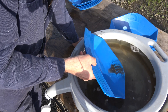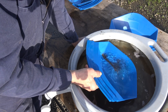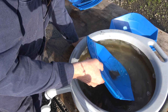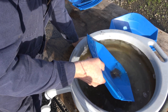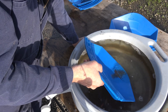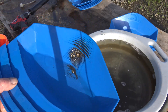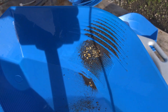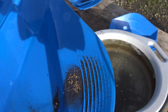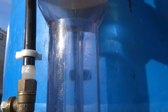There's some pretty dense stuff, no doubt about it. Now we got gold working its way over — look at all that gold! Let's just do this one more time. Boy, that's some really dense stuff — it's not black sand anymore, this is something entirely different. I'm never going to separate that out with just this technique, but you can see the gold there. So what I'm going to do is dump that through the gold drop to clean away the rest of that black sand. I have the meter set at 0.6 gallons per minute — that'll keep most of it up into the trap.